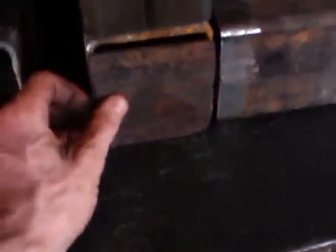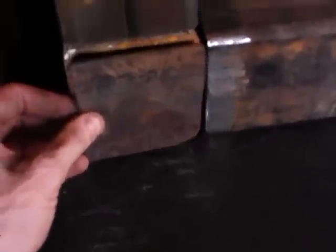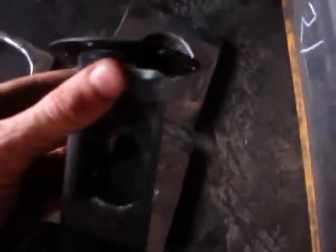Now I'm going to weld plates, little plates I've cut out here, onto the ends of the cubes. Obviously that'll go a bit higher and cover the cracks and seal the ends. And now there's three with holes in. So there's those two with holes big enough to take the fuel and hydraulic fluid inlets, well, inlets or where we fill the tanks from.